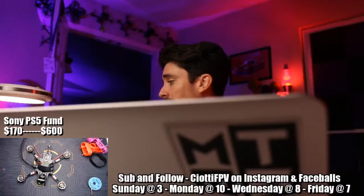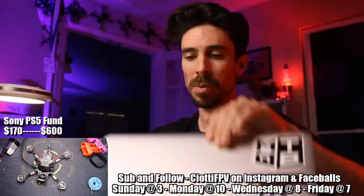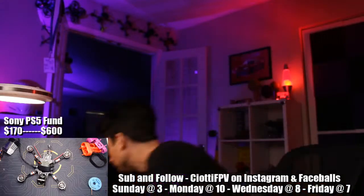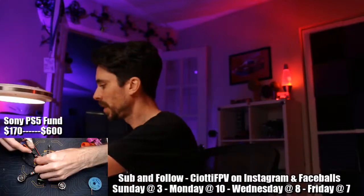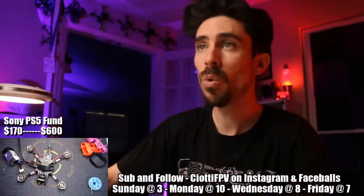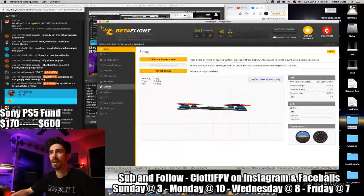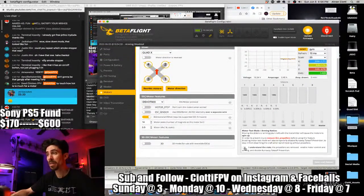So now we're going to go back, and I'm going to show you how to set all of this to be able to set the dynamic idle. Although, you know, I also like RPM filtering, so we would have had to do that to get RPM filtering up. So we are plugged back in, coming back over here. We're going to fire Betaflight back up. And all right, so we're going to come into the motors tab. Battery is plugged in, props are off.